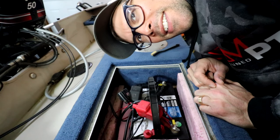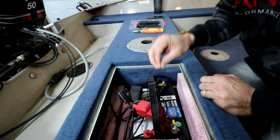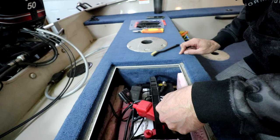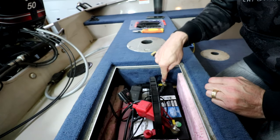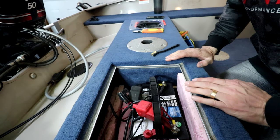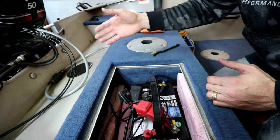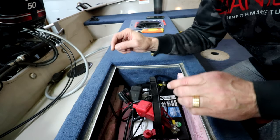The first thing you need to know is that unlike a car, especially on an aluminum boat, the boat is not grounded to the battery. So if you're touching a car battery and you touch the positive and touch the car at the same time — any kind of metal parts — you're gonna get tased. This is because the negative on the car battery is actually grounded to the vehicle, whereas a boat is not. They don't do that, especially not on a tin boat, because it can actually cause premature erosion and corrosion on the outside of the boat, the finish, the motor connection bolts, and where your trolling motor is.